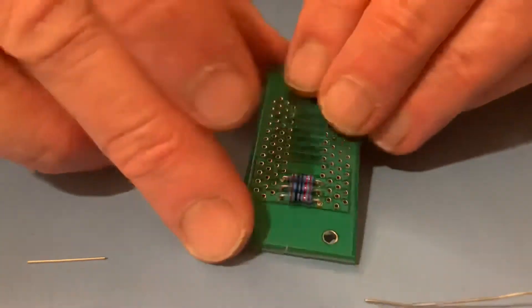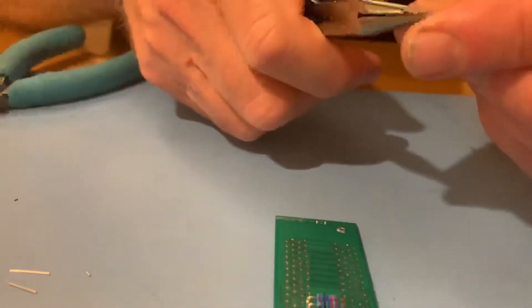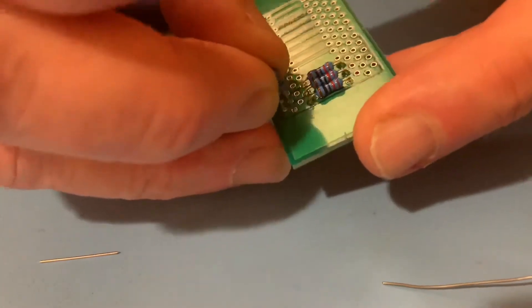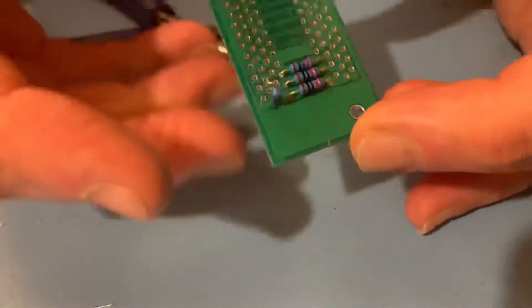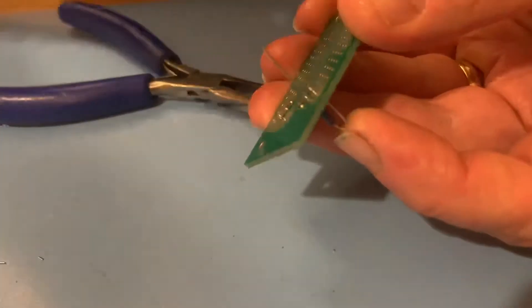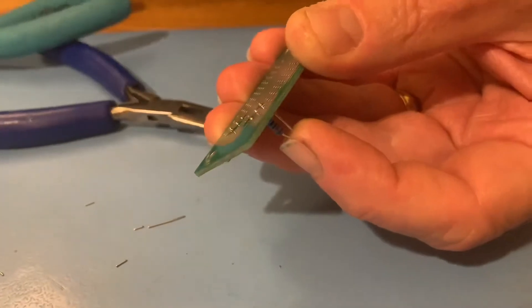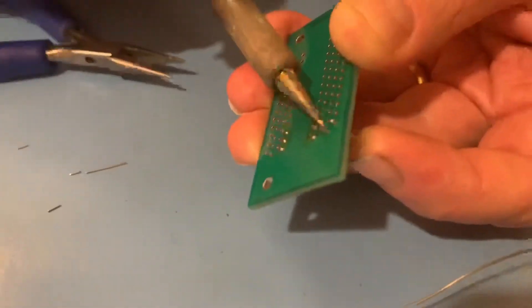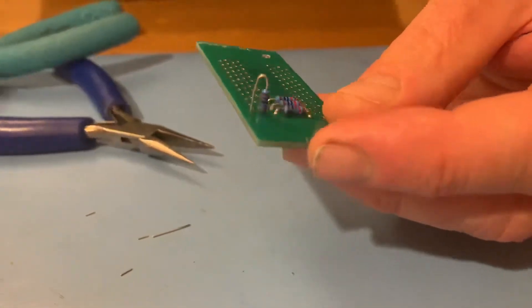Sometimes when you get a wrong footprint on the resistor there are two different ways to get around it. The first way: literally just bend it down so when you're limited with the distance between the pads you can drop it in flat so the body is touching the board — that's when the footprint holes are too close together. Crop them down — always cut your legs because if you don't you risk a short with the legs touching together. Add a little bit of flux, tin the iron, and touch that in. As you can see the body is touching the board with the leg nice and straight.